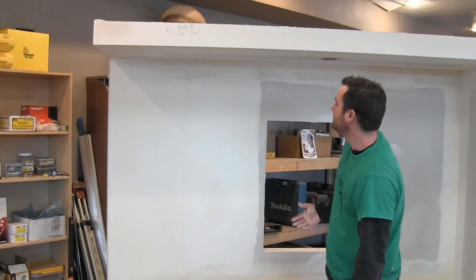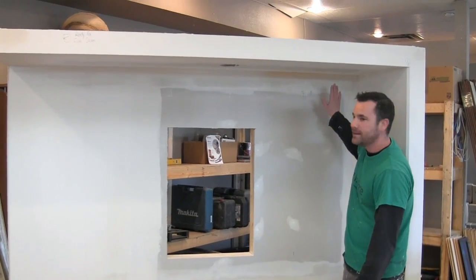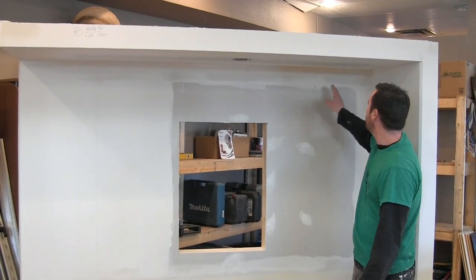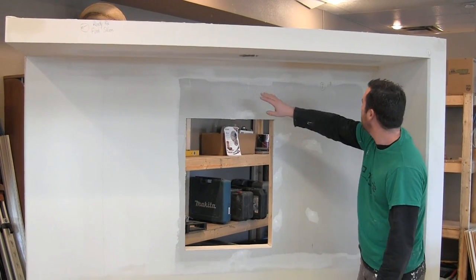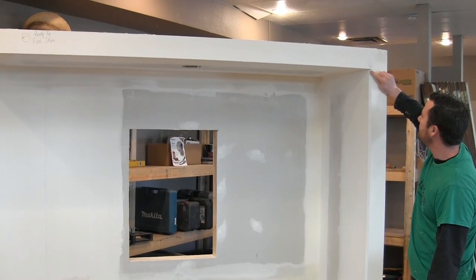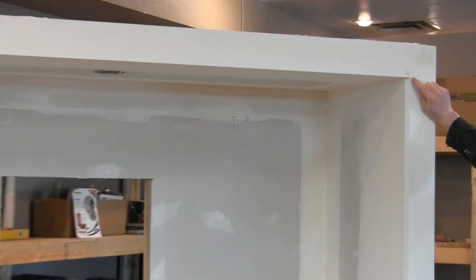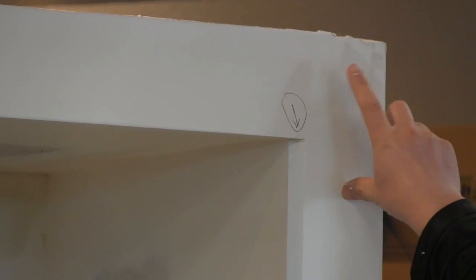After all the sanding was done, I figured I needed to hit the opposite side of my angles, so I did that. I did a 4-inch swipe all the way across there and one here. Then I fixed this little lip right in this inside corner and added a little mud to that. After that I made a few touch-ups, including this little outside corner.